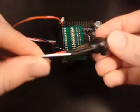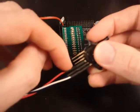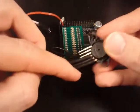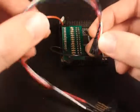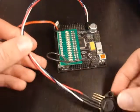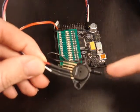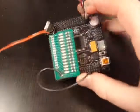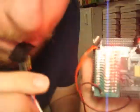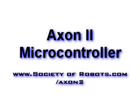This sensor is an MPX5100 pressure sensor by Motorola. It's a 5-volt sensor, so I give it 5 volts via this red wire I soldered on with heat shrink. Ground wires are in the center and the signal wire is on the far right. It's an analog sensor, so I plug it into analog channel 14. I've already uploaded my program, so I just turn it on. I need to blow into it to change the pressure. Thank you so much for watching.